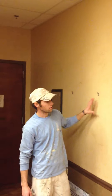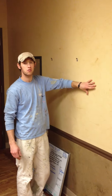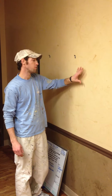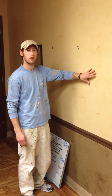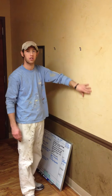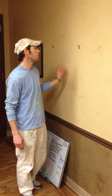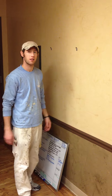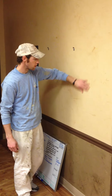So we start out with a base coat of primer, then we put on two coats of Venetian Plaster and then we burnish that second coat of Venetian Plaster. Then we put our clear coat on and we burnished that clear coat just to give it just a little bit more shine. The clear coat naturally has a shine to it, but if you burnish it, it gives it that little more of a high gloss finished look.